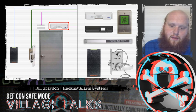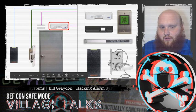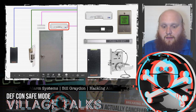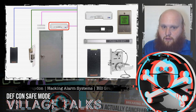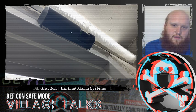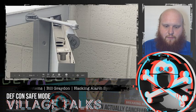In terms of the request to exit sensor, that is often done with a passive infrared sensor. Sometimes it's a button the user pushes to unlock the door and allow egress. It might also be exit hardware — pushing a push bar that will mechanically unlatch and also tell the controller someone is trying to exit and this is not an alarm situation. And in very high security environments, we might see another credential reader so you actually have to swipe your credential to confirm you are an authorized user exiting normally. In an emergency, there do need to be overrides, but that could cause an alarm.